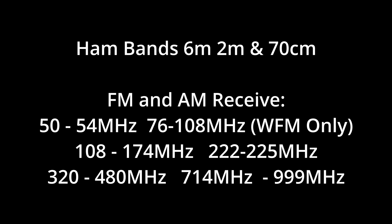The radio covers the six meter band, two meter band, and 70 centimetres band. On six meters and two meters it gives a maximum of five watts output, and on 70 centimetres four watts. Medium and low power settings are two watts and one watt on all bands. The receive coverage is quite wide — it covers the FM broadcast band, the VHF air band, and part of the UHF air band. On the UHF coverage you can switch to AM mode, meaning you can cover the higher portion of the military AM air band.